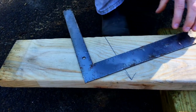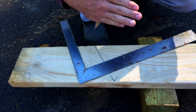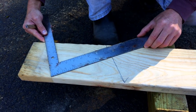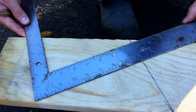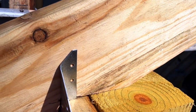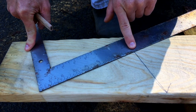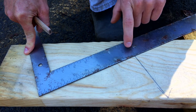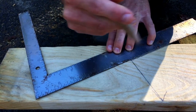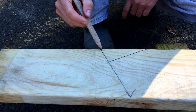Next thing we want to do is the bird's mouth cut — this is where the rafter is actually going to sit on top of the wall, this is the outside edge of the wall, plumb with the wall when the rafter is tilted up. We do the same thing: take your six and twelve and run it down sideways until you line up the eight on this plumb cut. Why eight? I'm going for a four-inch seat cut in that bird's mouth cut — the area that's going to sit on top of the wall, I want a four-inch cut. So when I have twelve on the edge, four inches away is eight — that's why I'm going to eight. Then just strike that line. This is what's going to sit on top of the wall, and this is the plumb going outside the wall.